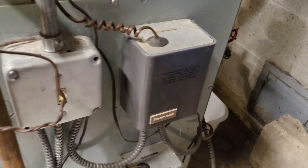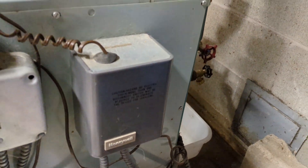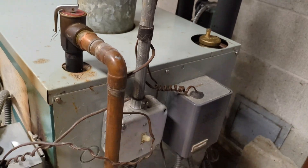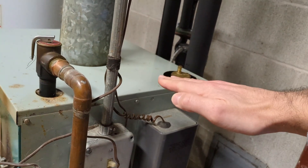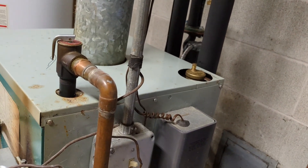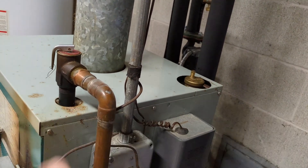So all that's left for water in this part of the system will be what's in the boiler and up as high as that shutoff valve. Then you're going to find your lowest drain valve — I have this one right here. Let a little bit of water out; you don't need to let out much at all. Or since you're replacing the valve, feel free to just open this up and let some water drain out right there.